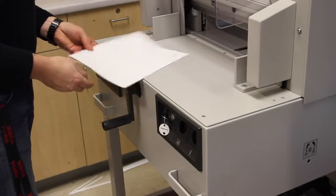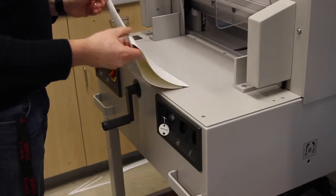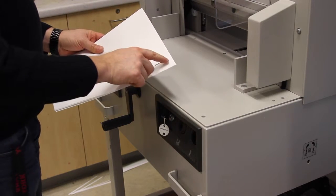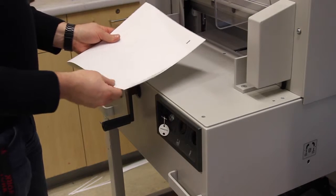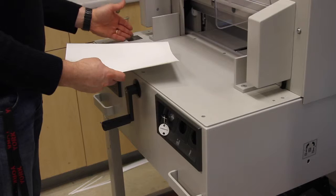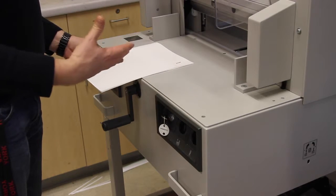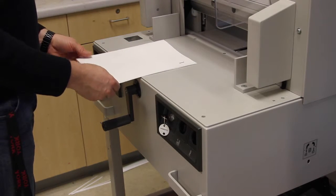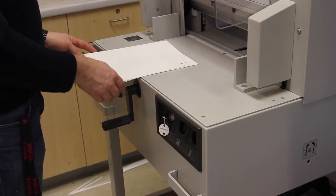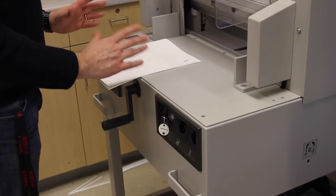Now the booklet that we saddle stitch, you can see we have our staples in here. The booklet is put together. Final trimming has to be done. We have crop marks here that indicate where we want to trim down to. The dial in this case is very handy because if we know what the final dimensions of this booklet should be, we can dial those in on our last 2 cuts to give us our final finished book.